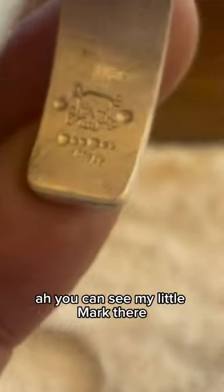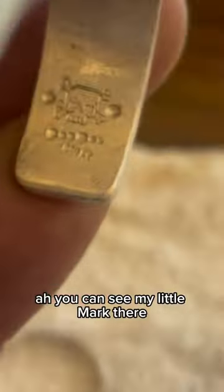This is a bracelet. It's about two and a half, maybe two and three quarters of an ounce of triple nine fine silver. I hammered everything out into the shape you see here. I did use the mill just a little bit to sort of flatten it all out, and then I went through and hand stamped and chased the designs on there.